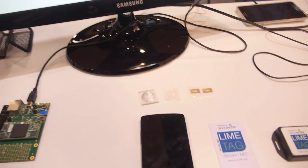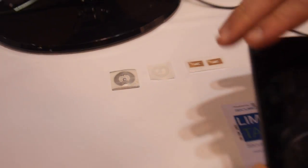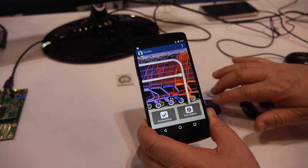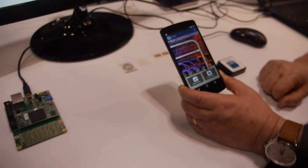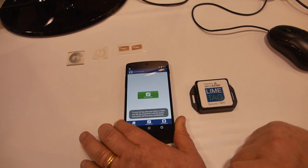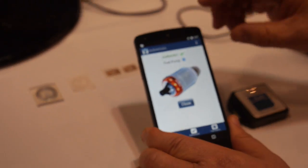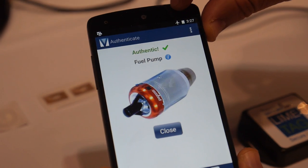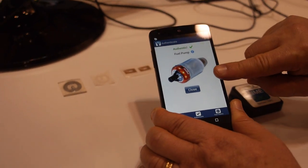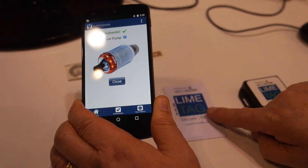These are passive NFC chips. We're showing a solution where if you wanted to authenticate products in the IoT, we have an app that will actually authenticate with a chip. There's a cryptographic engine running in the chip. All I have to do is hold it over the chip — when it turns green, I touch it and it does an authentication. What's exciting is the phone is in airplane mode, so this did not use any server or back-end processor. It actually did an asymmetric public key handshake between this phone and the chip in the tag to authenticate it.